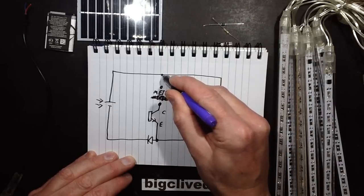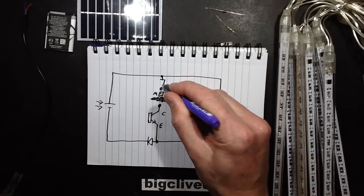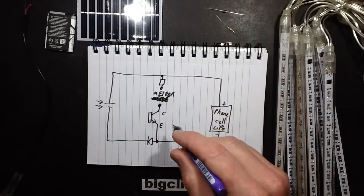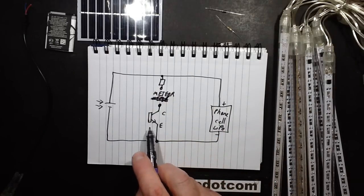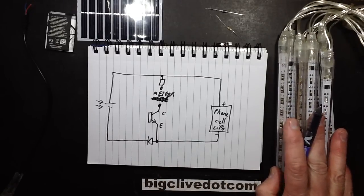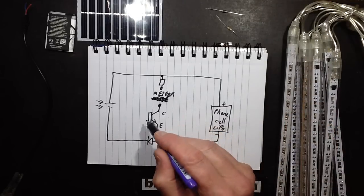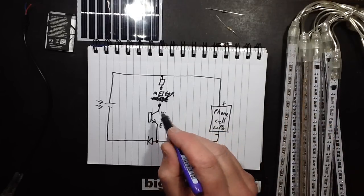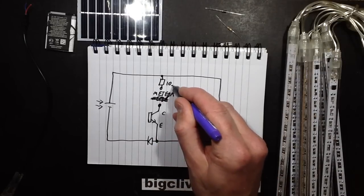And we'll put a resistor in here, and I reckon I've already looked out a 10 ohm resistor. It's an experimental value. It's just to limit the current, basically stop this transistor being overloaded. I'm not sure what current these will take. I don't think it'll be that high, but it means we can extend loads on without any risk of drawing too much current and damaging the transistor. It will also give a modest protection against short circuit. So we'll make that 10 ohms provisionally.